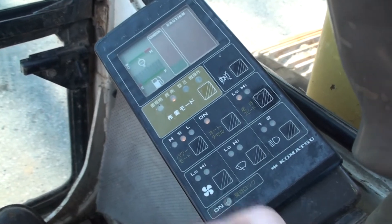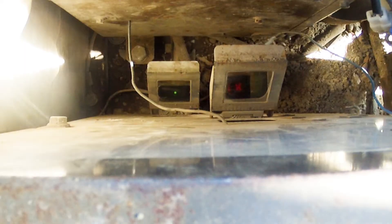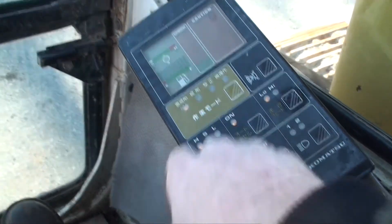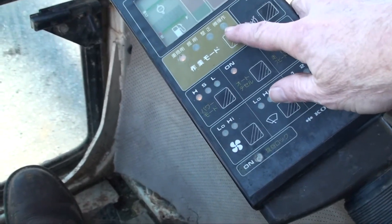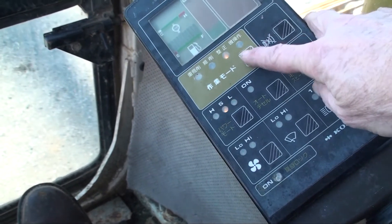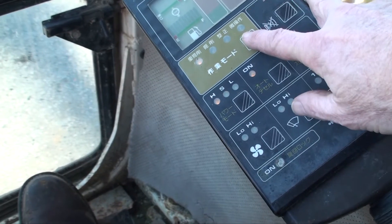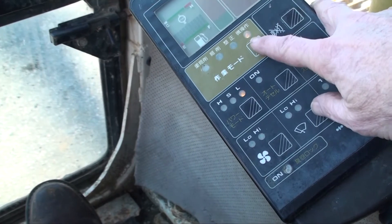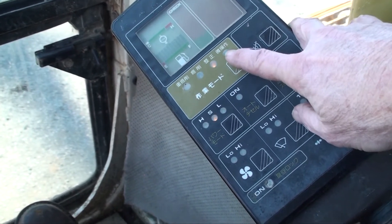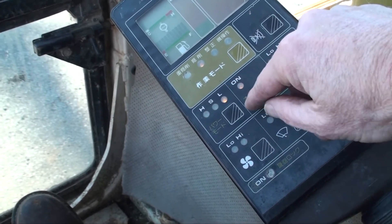The monitor panel communicates with both controllers. We're changing the modes, which will also change the display on the pump control. Cycling through it in the L mode, then the S3 mode, the S2 mode where the engine starts, and then again to the high mode, H1. Notice also below there's H, S, and L — those change the outputs or power positions on the pump-engine combination.